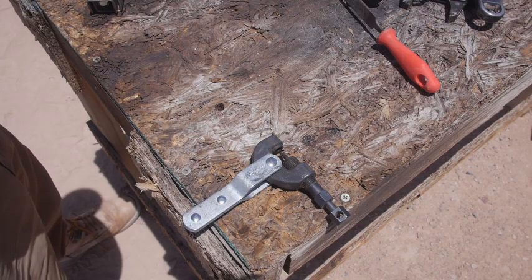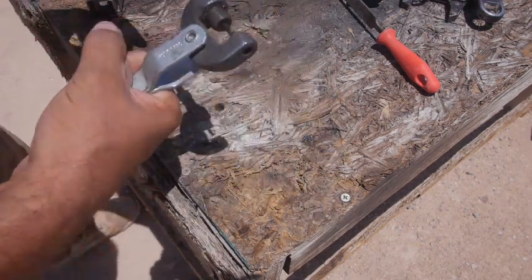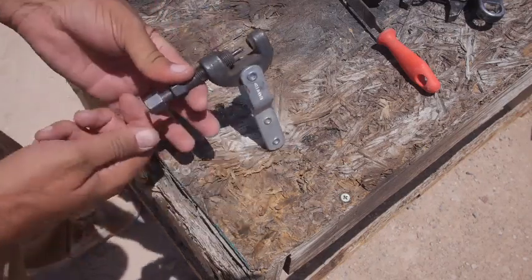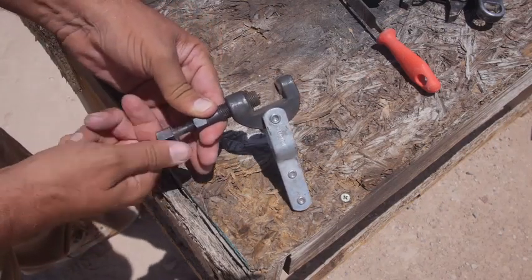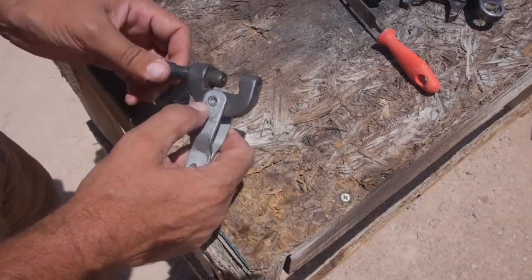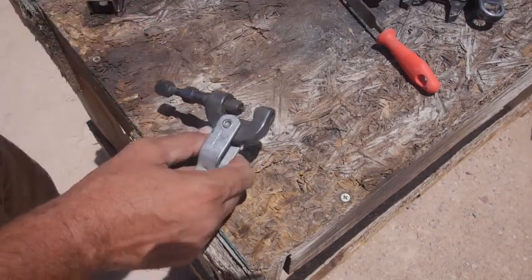You know, so after loading the bike down to within an inch of its life, I still didn't have everything I needed. So this is just a handle. This pin, first you back the outer part out, that pin retracts, slide this over the chain, put this end to hold it in place, and then you just tighten the outer one down and it runs the pin and just pushes it right through the chain.